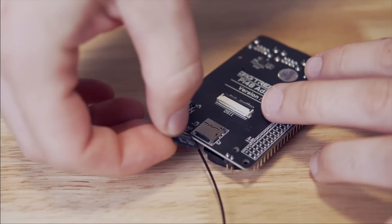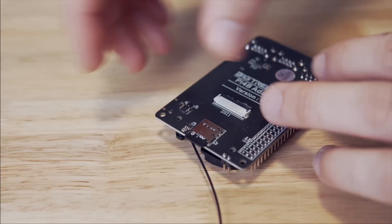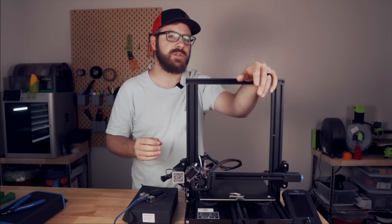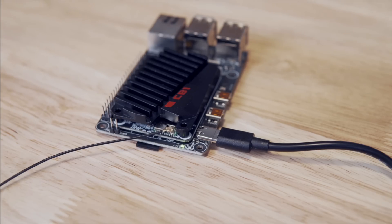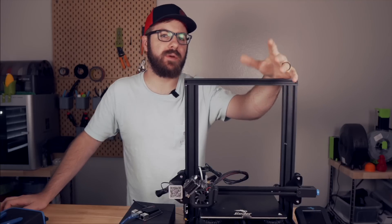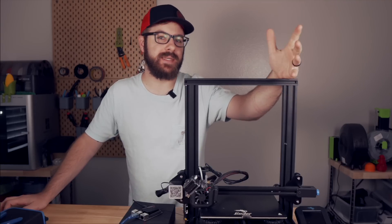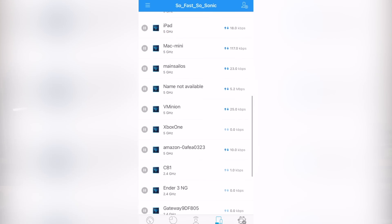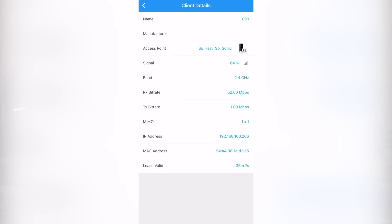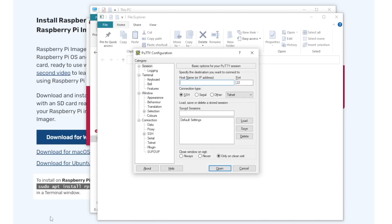All that is left is to plug the microSD card into your Pi 4B or Manta board and power it on. Don't worry too much about LEDs on the boards — eventually you should see a flashing green light, but with different kernel versions they seem to do different things with the LEDs. It may take a minute or so, but the CB1 will show up on your network named CB1. For previous versions of the CB1 OS, it showed up as Huracan. You will then need to log into your router to find the IP address assigned to your CB1.